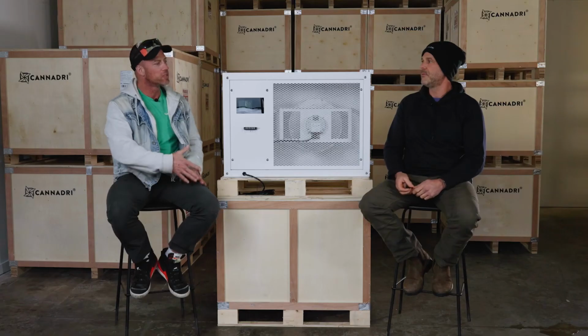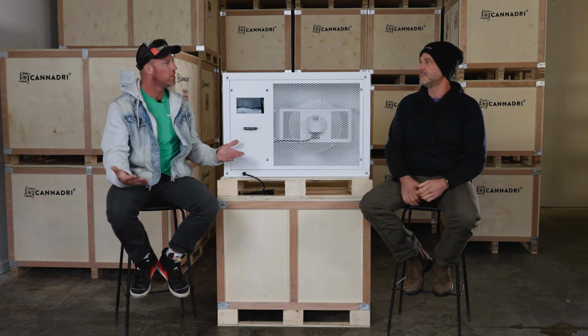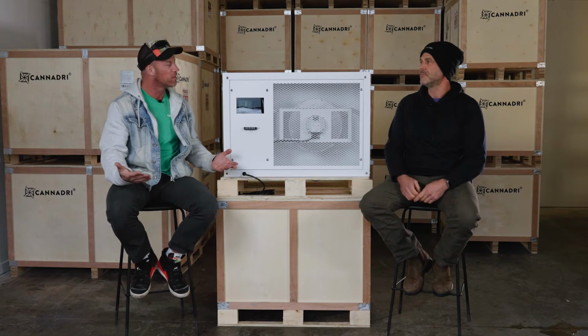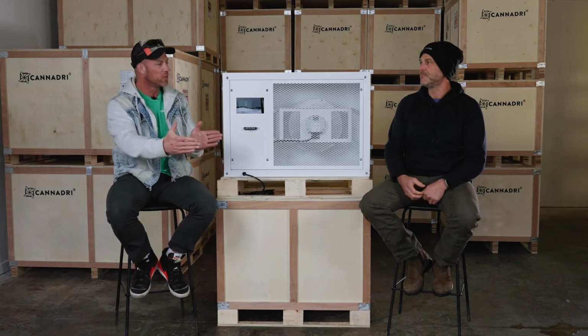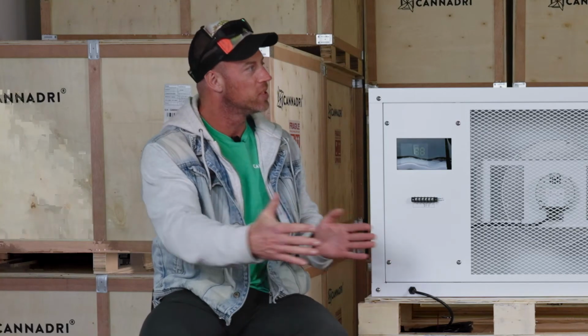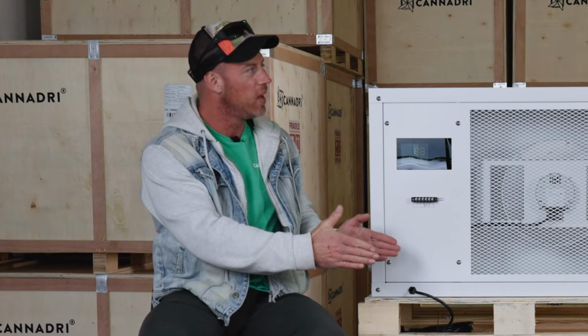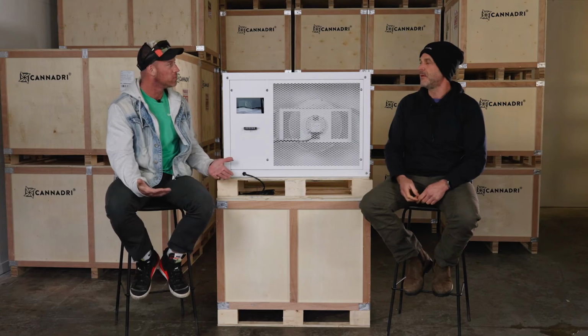And one thing I see that I think is a part of the issue is that people will take that wet weight, the 75%, and they'll go, okay, we'll divide it over how many days I want to dry it for, 14 days, right? Yeah. So that would only work out to, let's just say we use 1,500 pounds of biomass. That would only work out to be like 50 pints per day. And the problem is you need to dry that product mostly the first 48 hours, right? So when I do those calculations, I like to just take the first 2 days because you want 80, 90% for the first 2 days. So you almost can take that whole wet weight and calculate it over the first 2 days. In that case, let's say you had 1,500 pounds, right? You'd probably be about 300 pints that you'd need, right?